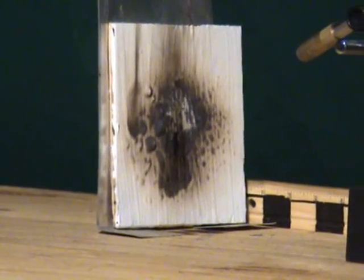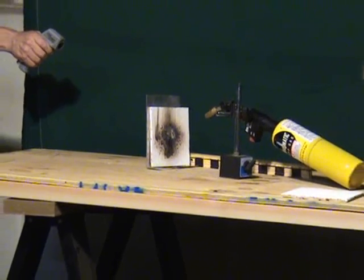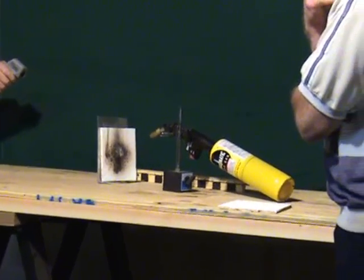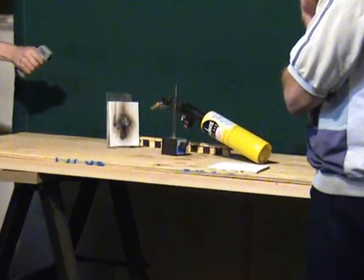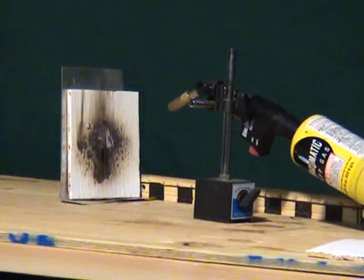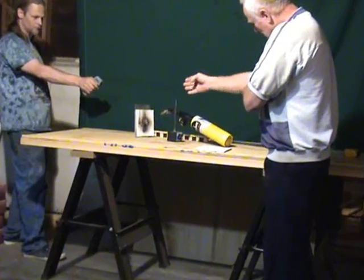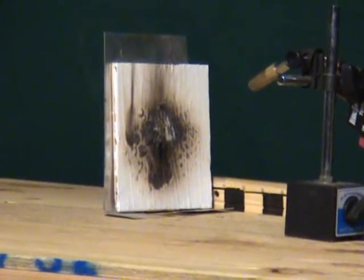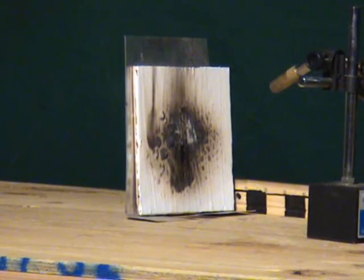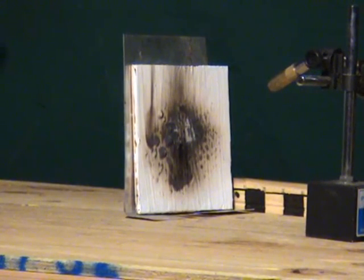Go to the back and check the back. I got 502 on the front just a second ago. Now check the back. Okay, we're flamed out, but we got quite a bit of combustion. 124, 140, 43. It's coming down slowly. So this is a 20-second test. Now starting to go back up. Hold your laser at a center line straight in the middle of the impinged area. 159, okay, 161. It seems to start going, it's going back down again. Must be going out.